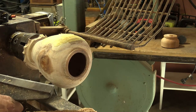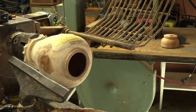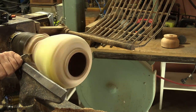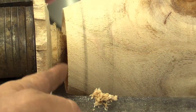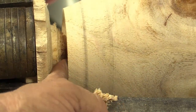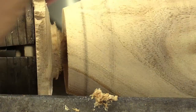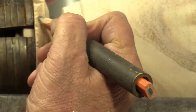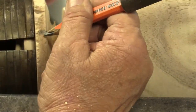Now that this is done I don't have to worry about so much force being placed on the wood. I came in here with my parting tool and made it concave because I'll put some kind of decoration down here probably. I took it all the way down — that's still holding this on, and that's good enough for right now. I put number three on one of my chuck jaws — I always mark these because if I take them off I can easily realign this pretty close to where it was. Always mark it so I know where to put it back. I like to put a little bevel right here — I don't like to have it just sharp and square. I'll sand it.